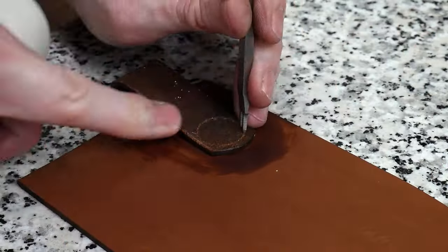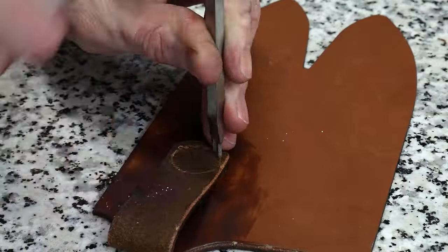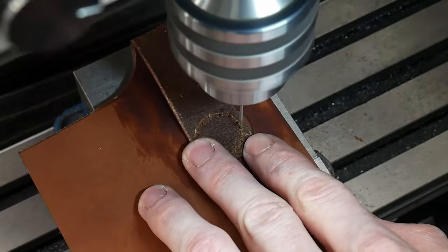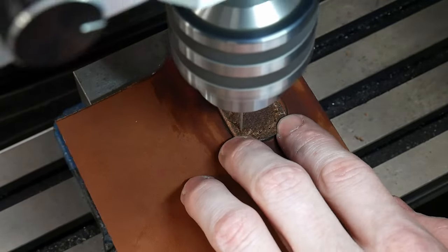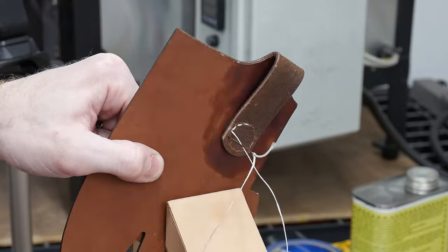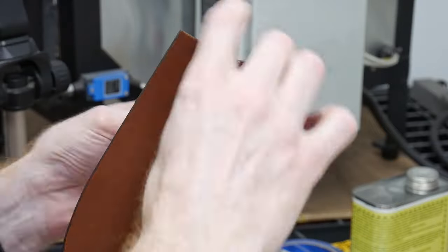I used a 4mm space pricking iron to mark out my holes in the belt loop for drilling. When drilling these holes, I'm not using a traditional drill bit, but instead I'm using a large-ish OD needle chucked in my drill. This simulates a punch, and I feel like it's a better option than a drill bit.